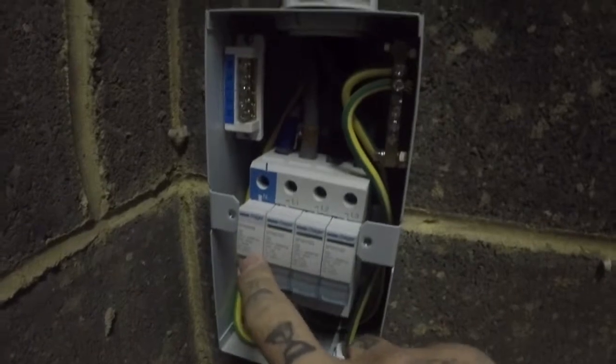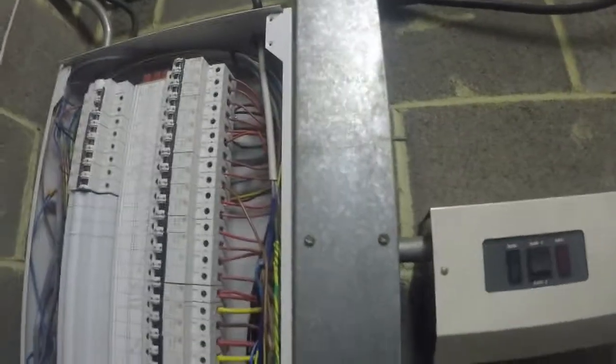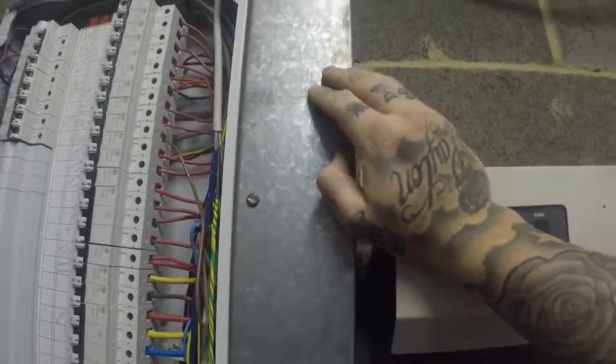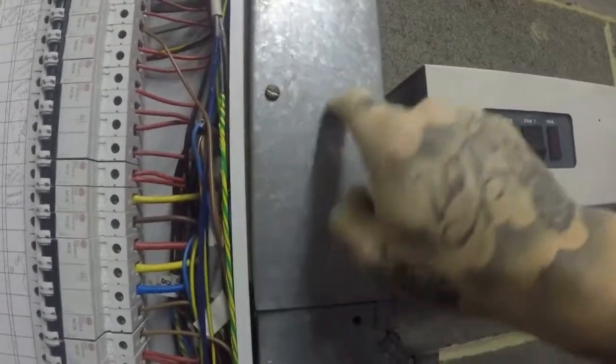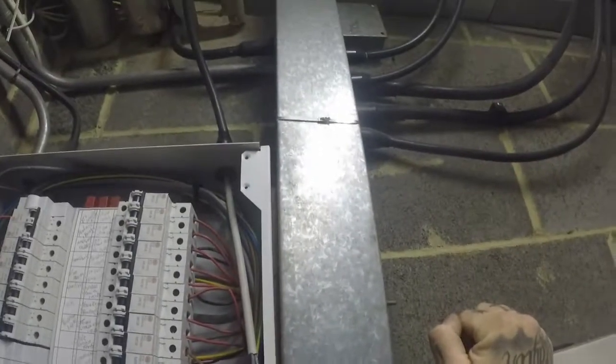I've also got a link of the earth from the surge protection device into this, and also taken another loop out. It's just clipped along there, and I've joined that in with the earth busbar as well. So this one is a wrap. Even put the metal cable tie around that. It's absolutely rammed behind here, so there's no way we could self-tapper it, which is what I'd normally like to do, and these catches won't catch either because there's a risk of going through a single cable because it is absolutely chock-a-block. But we'll get the fuse board lid back on.